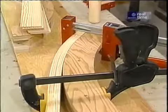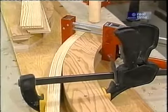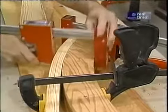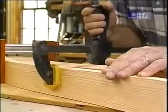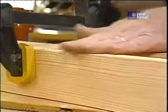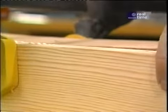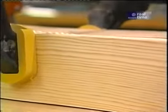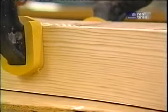Okay, I think it's time to throw on another clamp — this time from this side. Now, squeezing it a little more. I also want to pay attention to make sure that the top of these individual pieces stay as even to one another as possible, and tight down onto the bottom of the jig. I don't want them to start riding up next to one another. Okay, time for another clamp.